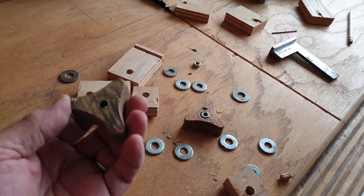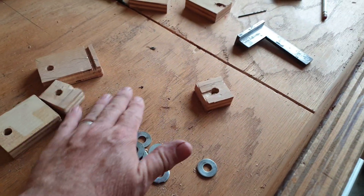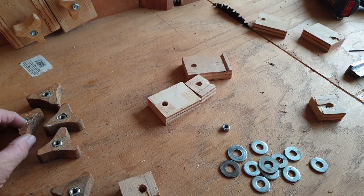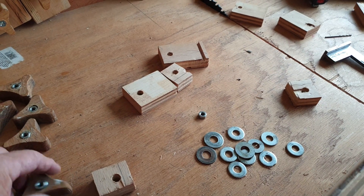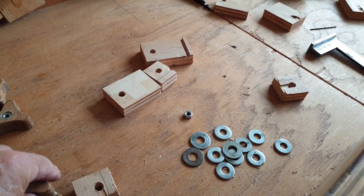Hardware left over - I made these knobs about four years ago and most of them held up pretty good. I do have one knob that's missing, I don't know what happened to it between the spacers and all. They were cut out on the CNC and the hex nuts were milled in, then I just shot a little bit of super glue on them. For the biggest part they did pretty good and lasted quite a while. The only ones I had any trouble with were the ones I put in backwards where the nut had popped up - as long as the nut pressure was down and holding, it was good. An easy fix would be to put two knobs together to lock them in.